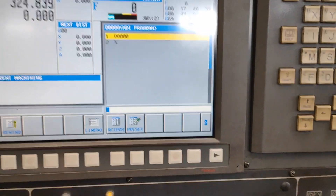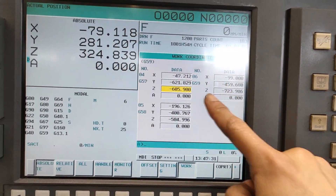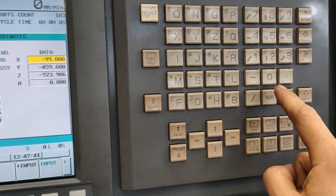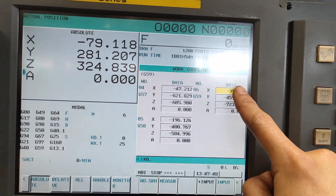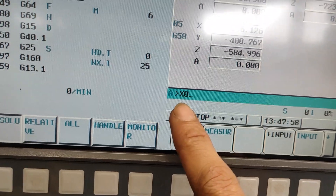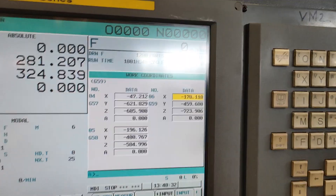Do not move it. Go to your machine monitor and press offset setting, go to your designated coordinates — by this time I'm going to use G59. Highlight the X, then press X zero, and then measure. When you click measure, this will change and your absolute will become zero. So let's do it now — measure. This is the X zero, then measure, so your absolute becomes zero and the value of X changes.